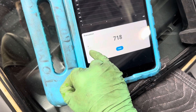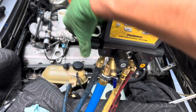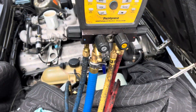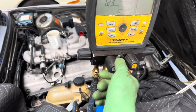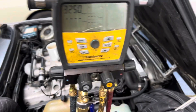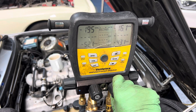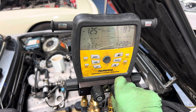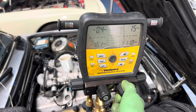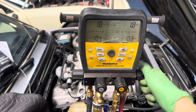You can see it's barely going down, so let's give it a little jet of nitrogen. I close off the low side — we're going to follow the normal flow from high to low — so kill the vacuum and let's give it a little burst of nitrogen.